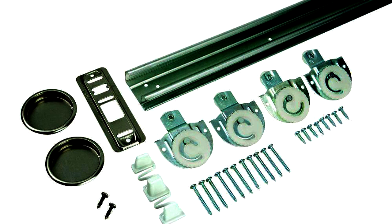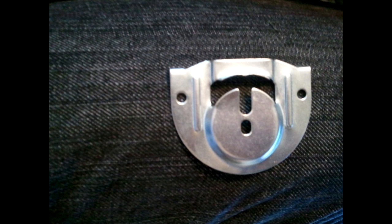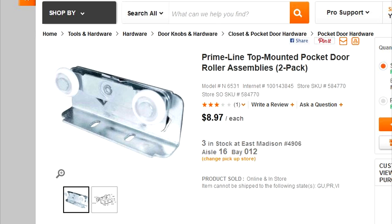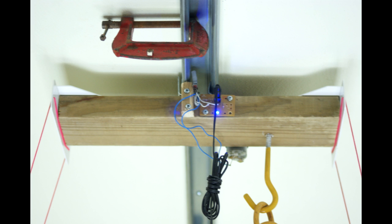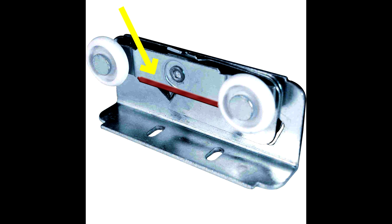Now that the hardest part of soldering the switch is over, let's talk about the rail itself. The rail was a set which came with screws and these four rollers highlighted in red. Those rollers came with a metal and plastic piece attached, which I removed. I took the rectangular roller piece which remained and bent it into a 90 degree angle and was able to screw that down onto my piece of wood. Now because I messed up two of the rollers, I went to Home Depot and purchased another roller set which was able to screw in without bending anything. If you end up buying the additional roller set, one thing to mention is that there's a small piece of metal which grinds against the rail and prevents the rollers from moving smoothly. I solved that issue by taking a dremel tool and a metal file and removing that small section of metal, which allowed my rollers to move more freely.